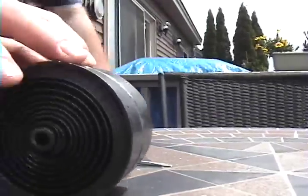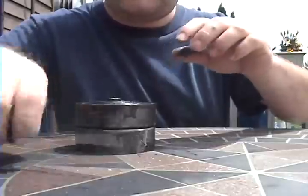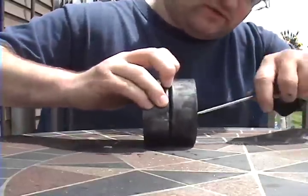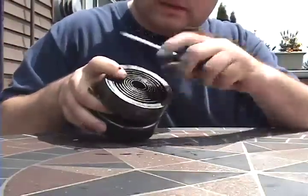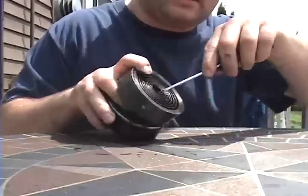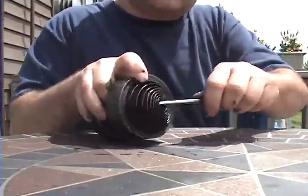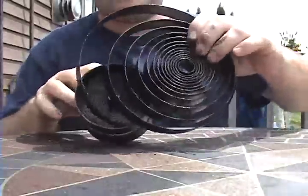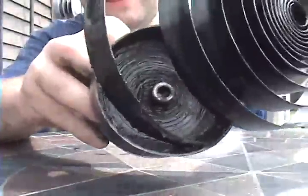To remove the hundred-odd-year-old spring, the first thing we've got to do is disengage the center shaft from the spring. That can be done with a flat blade screwdriver — just pry between the spring and the shaft and allow the shaft to come through the cup. Then you want to grasp the spring right in the middle. Now this is going to go flying — this is why it's so dangerous. Try to pull the spring out and then slowly allow it to unwind. Note the direction of the spring — this one winds clockwise. And as you can see there's a lot of filth in that cup.